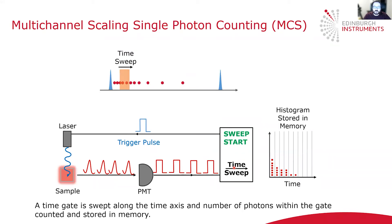How this works is that the timing electronics has a time gate, and any photons that arrive within this time gate are counted, and the number of photons that arrive within the gate are added to the histogram stored in memory. The time gate is then moved to the next position in time in order to see the photons that arrive later, and the photons in the next region are counted and added to the histogram.